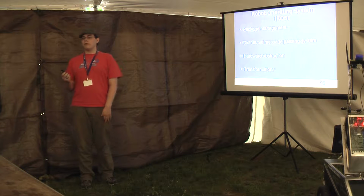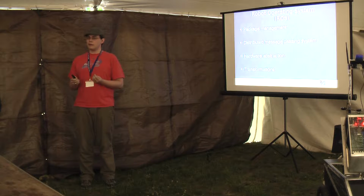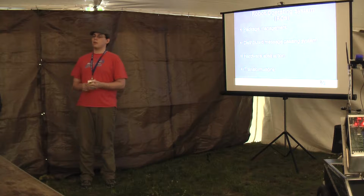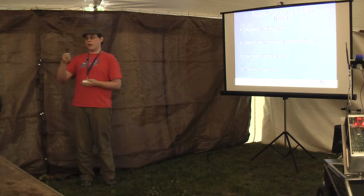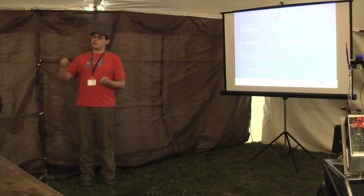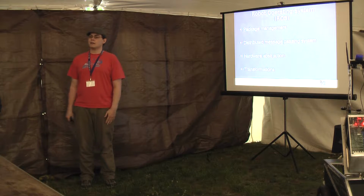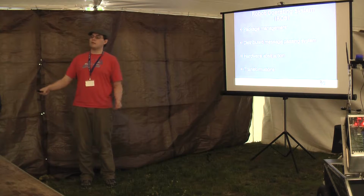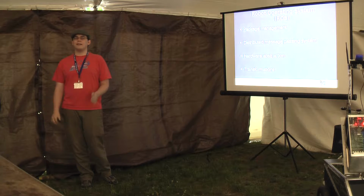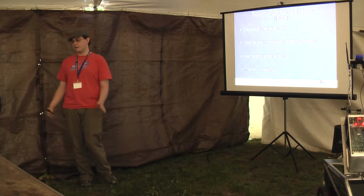Finally, one of the key features of ROS that we're definitely trying to leverage this year is the transform tree. We build a tree of physical transformations between different frames related to the robot, like where the laser scanner is, where the center of the robot is, where the camera is pointing, and where we might be anchoring maps that we're building. We publish the individual links of this transform, and ROS provides a utility for listening to all of them. We can ask what a message would look like in a different frame than the one we have it in. That automates a lot of annoying math that can often lead to hours of debugging, like putting a sign in the wrong place, or should it be a negative sign.